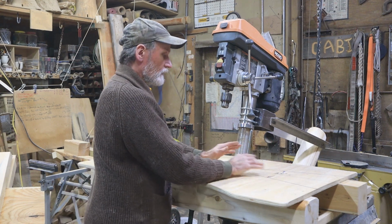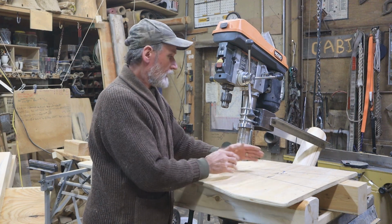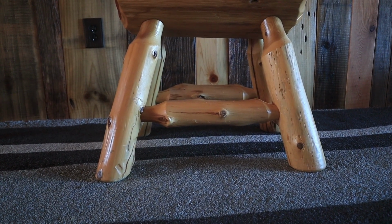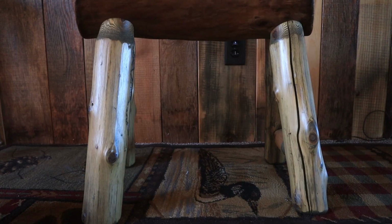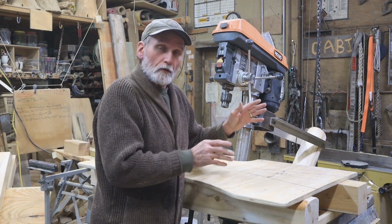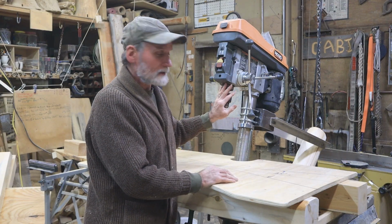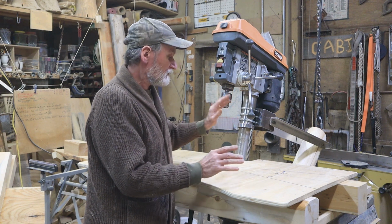28 degrees as far as the pattern works exceptionally well, because if you have 90 degrees instead, then the legs on the benches flare out more on the end. I think it looks silly. They need to come mostly this way and only a little bit that way. You need them to go a little bit that way for stability and so that they look right, but they need to go mostly this way. And when you are calculating, I'm sorry, you can't use the 1.41 rule exactly with that because it doesn't work. Since this is 28 degrees, you're more going back to a third of that with the 1.41.